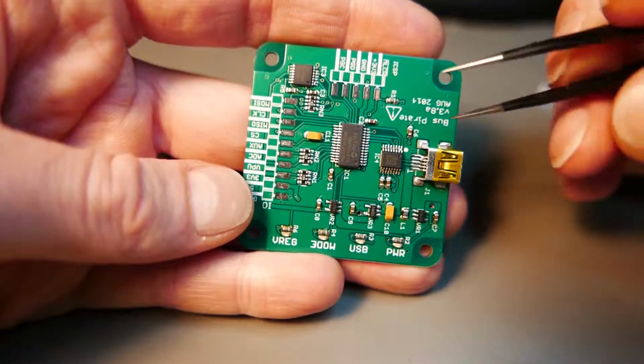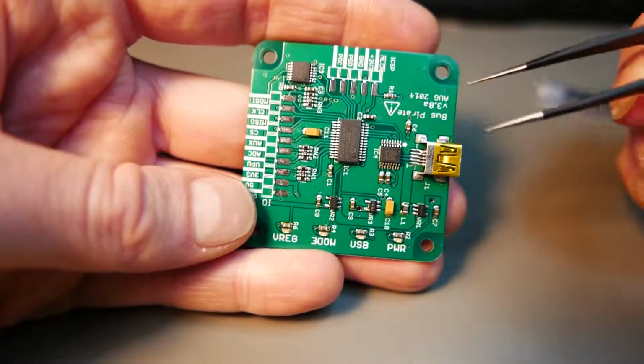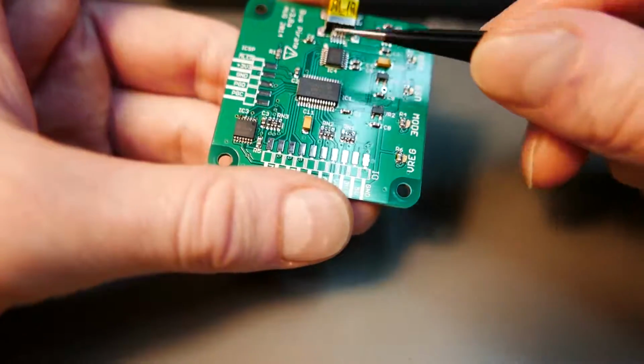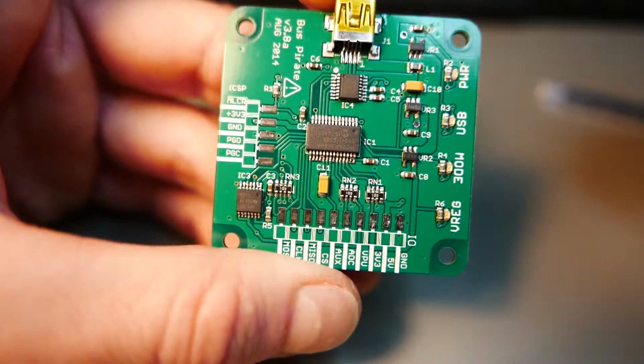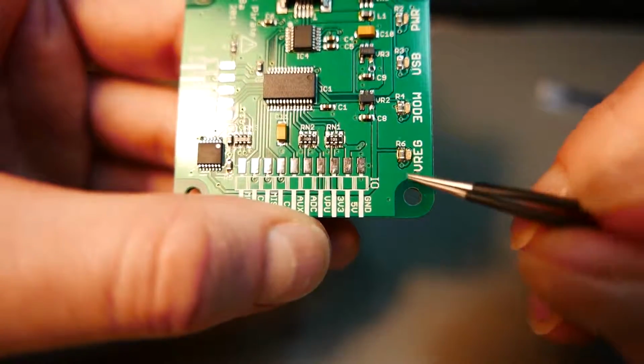it's too short and too quick, and the dwell time, the time above 200 degrees, about 210, was not long enough. But all components have reflowed successfully. Can you see it? Except this one.